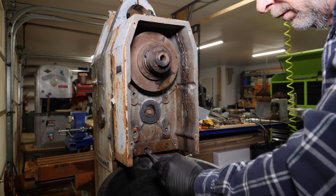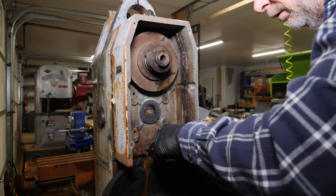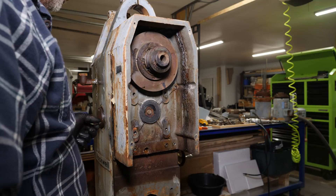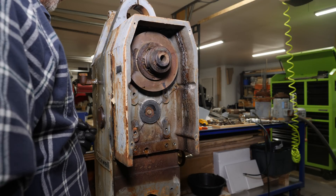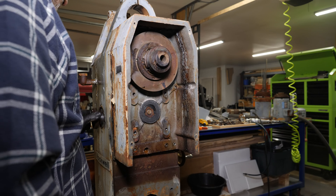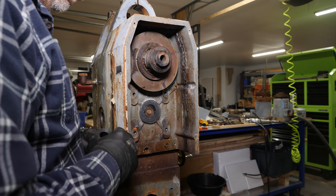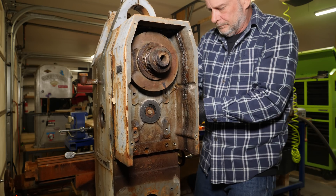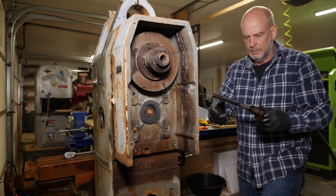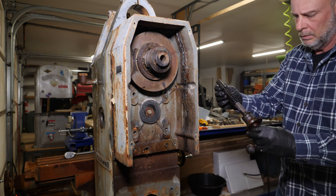I get a bunch of muck — yes, that's water coming out of my milling machine. Here I'm taking apart the back gear engagement shaft and it is seized on the other side. There's a collar that goes around the shaft and it has some roll pins that index the location of it, and it's actually seized up so I had a little bit of a hard time getting that apart.